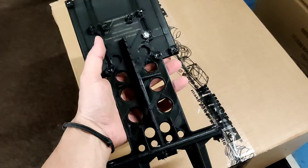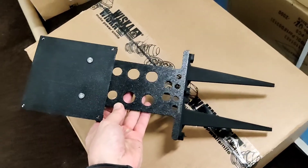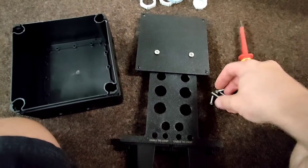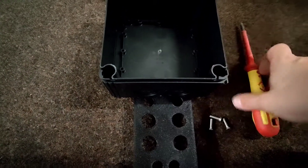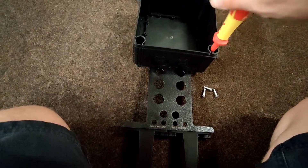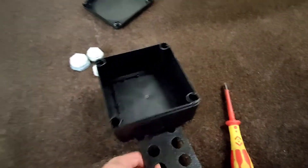When we do a bundle we only laser one part of it, as there's no need to laser everything else. Now we're going to get the box on there — it's completely the wrong screwdriver, but the plates come with these M4 screws. You just need to line up the four corners and drop your screw down there. I probably need two hands for this — basically screw all four corners in.